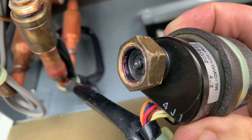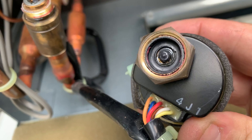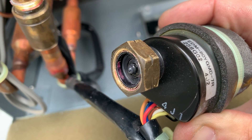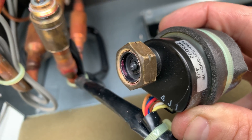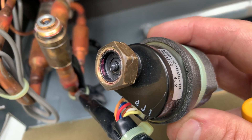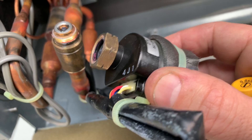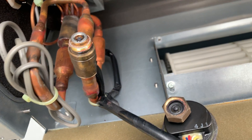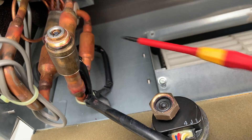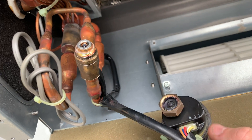And then obviously this is the motor. You'll see that pin is pretty much wound all the way out, so that'll be closed. Then as it drives back in, you should see it winding - it's got to open up the valve. Now if you've got one that's stuck out like that and it's asking for 1800 pulses, as you start winding that off you'll start hearing the refrigerant start passing as the plunger rises and you'll feel the heat pass through if you're in heating mode.